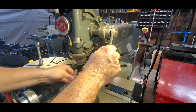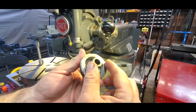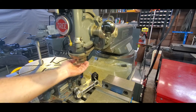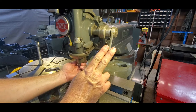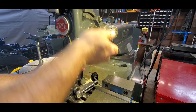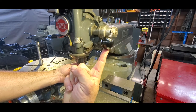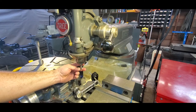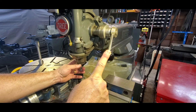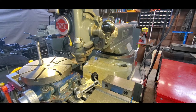Up on the handle, open the yoke, down on the handle, screw the nose off — here's a close-up of it. That's where the collet goes — screws right on there. Pull down on the handle, screw it closed tight, back off a little, put your tool in. While holding your tool, pull up on the handle. When I say over center — there's like a click, see there's resistance right there, and then I keep pushing and it closes the collet. If it's not quite tight enough, with the handle all the way down just turn this knurled nose a little bit more, then pull up. That's nice and tight — done. Very simple, nothing to be afraid of.